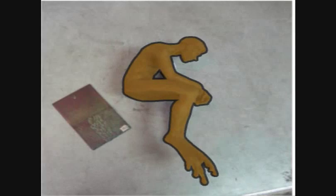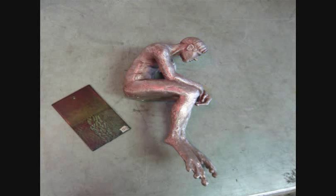Next comes chasing, the term for cleaning up, repairing, and refining the bronze cast. This includes grinding off the leftover nubbins from those wax sprues, sandblasting, and fixing any imperfections. And now the piece that started out in an altogether different material is reproduced exactly in bronze. And it's ready for color.